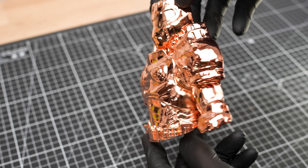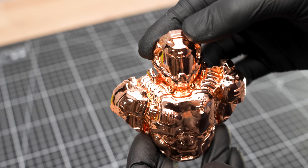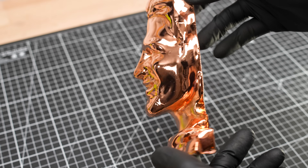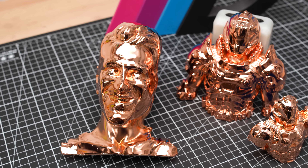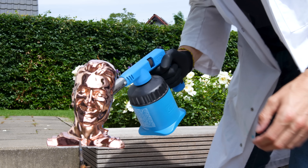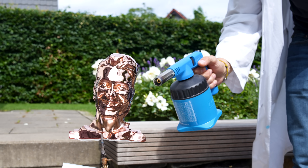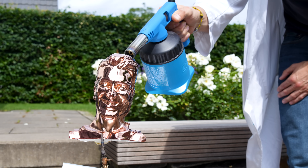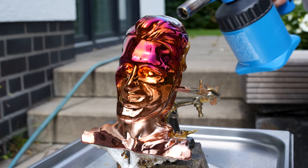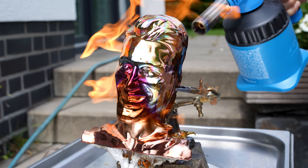They already look great — the parts come out of the bath almost exactly like this. The electrolyte contains an organic brightener, it's well balanced and works reliably over a wide operating window. Still, even with rotation there are a few spots it just can't reach geometrically — polishing works there. Now for the fun part: burning out the casting filament and resin. I use a gas torch for this with all the safety measures in place — garden hose at the ready and a fireproof tray underneath. The filament burns nicely, but I didn't factor in how quickly the clamps lose their grip. You get a good view of how copper reacts to heat.